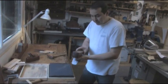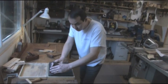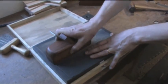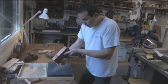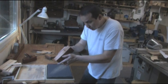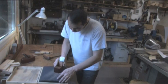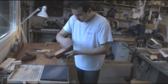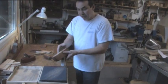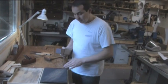So I'm going to take another couple of strokes now, again using even tension. And we've almost got rid of those low points. Bingo — and there we are. We've now returned that plane sole to being as flat as your flat surface.